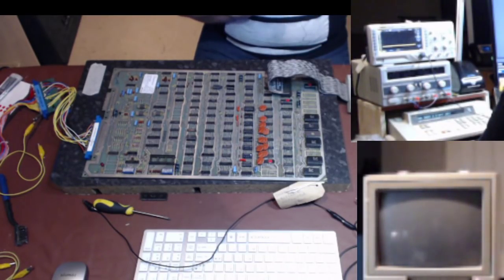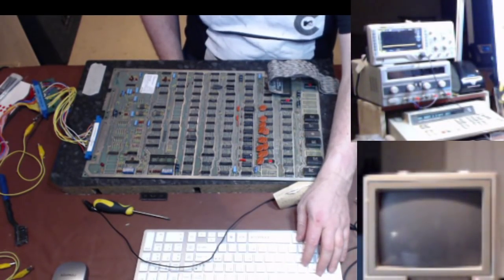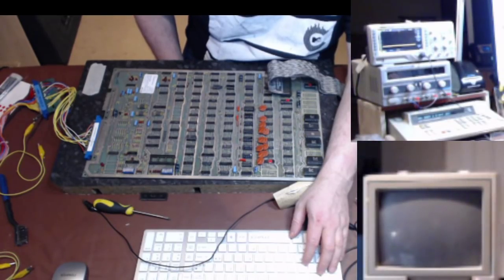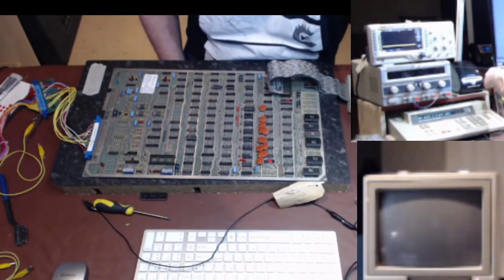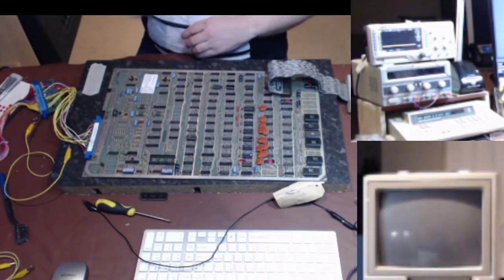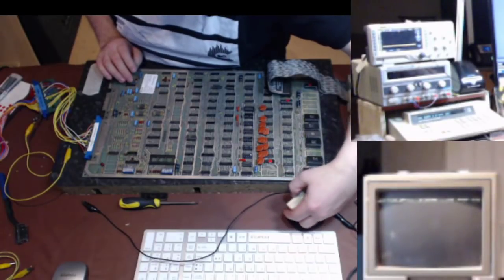So I'm just going to check messages and so on. Anything I care about there, let's look at comments. I forgot, so give me a second. He's doing a RAM test. He's not complaining so far, which is a good thing. And that should let me start the board in a moment. If it comes back okay, then I'll try and start the board. But I'll do it in test mode. I don't want to start it up in real mode, because there might be other issues. I'd rather it start in test mode, and I don't think I'll see anything until I put the pokey chip back in anyway, because I haven't put that back in yet. I've got to find the pokey chip.